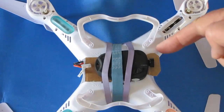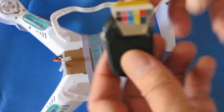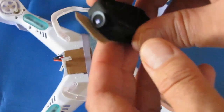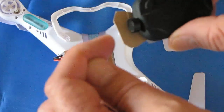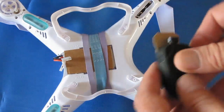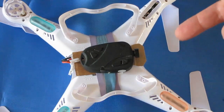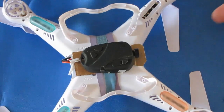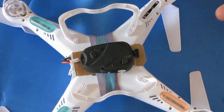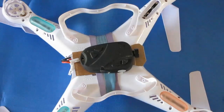One thing you'll notice on my 808 keychain camera is a small piece of cardboard. It's a trapezoidal or diamond-shaped cut piece that extends over the top of the lens. The reason it's there is to block the shadow of the propellers from hitting the camera lens — this prevents propeller flicker, a phenomenon that occurs when the sun is low in the sky and the propeller shadows cause a flickering effect, especially when flying toward the sun.